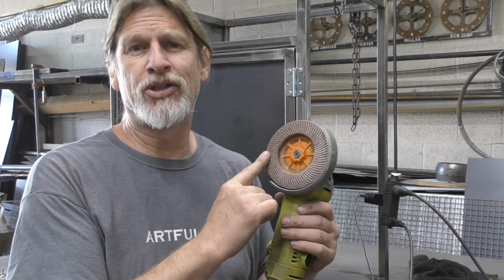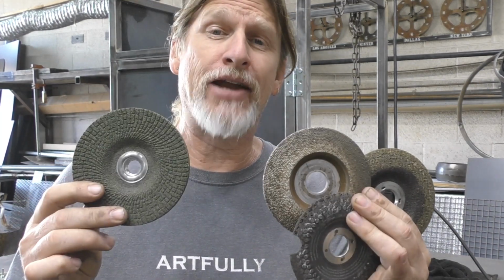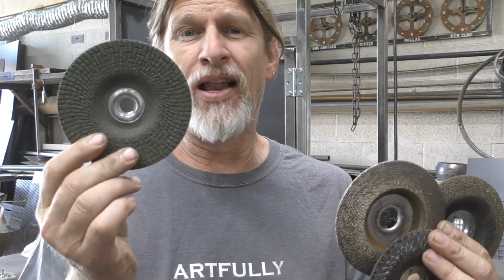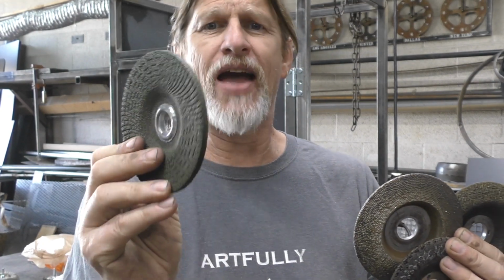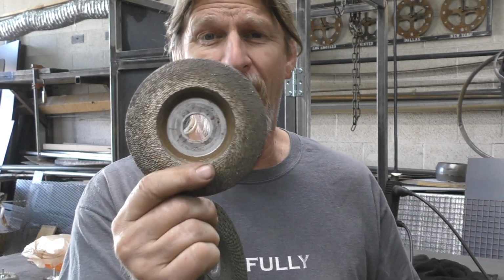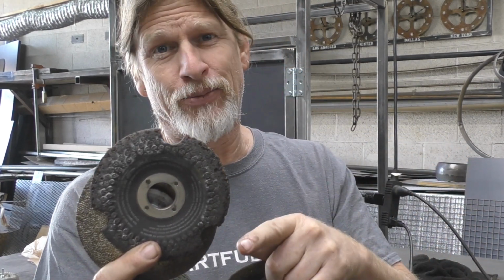And after you cut the metal, you want to deburr the edges, grind it up a little bit. That's when a flap wheel comes in handy. That will help clean up the edges for you. And there are also so many other different types of discs that you can add to the grinder. Something that will take away a lot more of the weld or a lot more of the metal is something that's a bit thicker. It's a heavy-duty grinding wheel. They even make diamond grinding wheels. They make ones with little holes in them, so as it's spinning around real fast, you can kind of see your work that you're grinding away. So the grinder is the number 1 tool that I use in my shop.